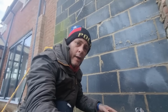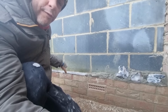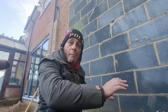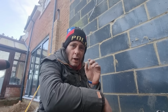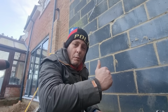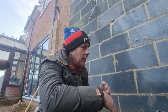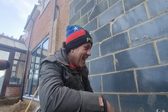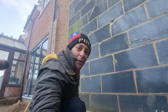What my idea is, as I come along here, I want to get a whole course along. I want to get quite a lot done right away along this wall, first course. Then once they're all on, I can go back to the beginning and start laying again on it. It gives it a bit of time to go off. Then you can start stacking them little by little as you go. But the main aim is I want to keep them nice and close together. I don't want big gaps in between them, because one, when I come to pointing, you're going to use loads and loads of mortar. Two, the wall is supposed to be flint. If you're doing brickwork, you don't have massive joints, so I don't want massive joints on this either. I think, in my view, it looks aesthetically better pleasing on the eye. So, let's crack on with this and get this first course on and see how we get on from there.